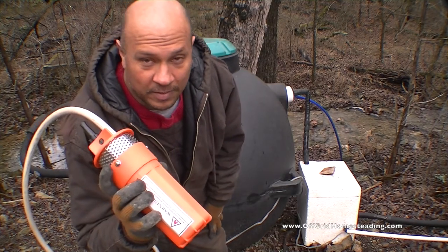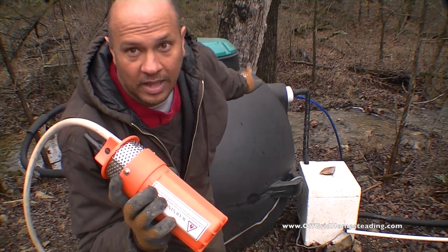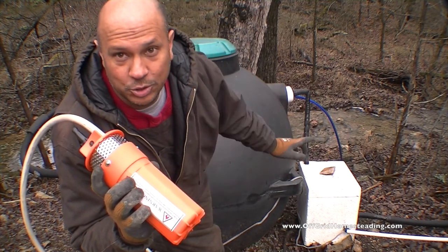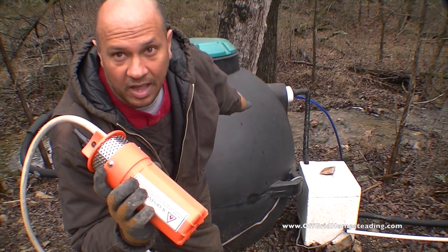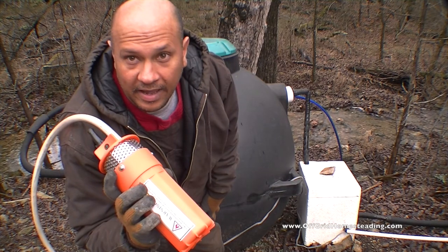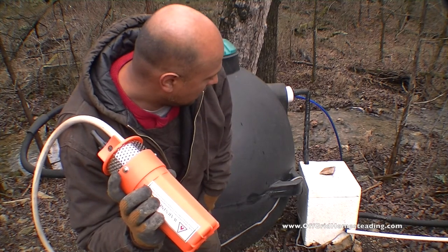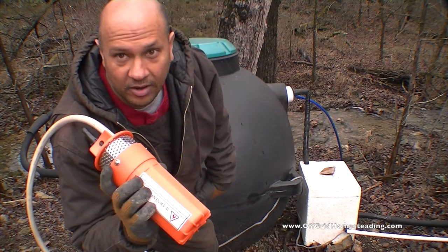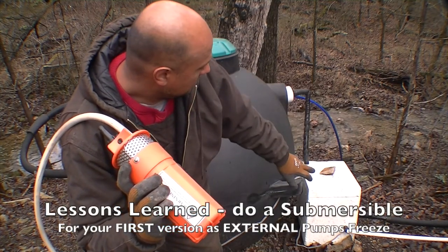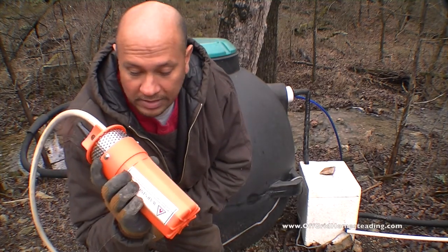So with this pump I'm going to be installing it inside the cistern. I've got to drill some holes in the side of the plastic here for the pumping lines going up into the system. But I've got to make sure that the PEX goes all the way to and inside the top cap here, otherwise it will freeze and expand and crack. All the metal parts in between seem to crack, so I have to eliminate all of the metal pieces. What I should have done is run this continual pipe directly into this tank the first time. So let's go ahead and get started.